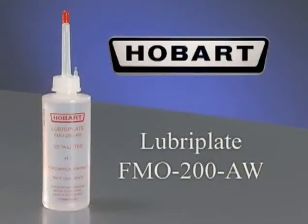The slicer lubrication system requires that the reservoirs under the carriage transport be refilled with Lubriplate FMO-200-AW oil after approximately 1 year of normal use for a manual machine and approximately 6 months of normal use for an automatic machine. Slicing for more than 2 hours a day may require more frequent lubrication.